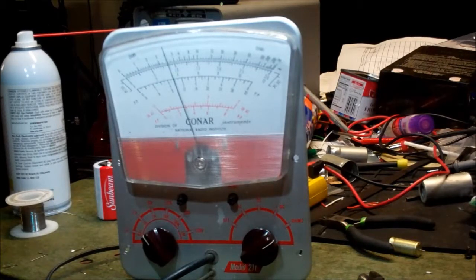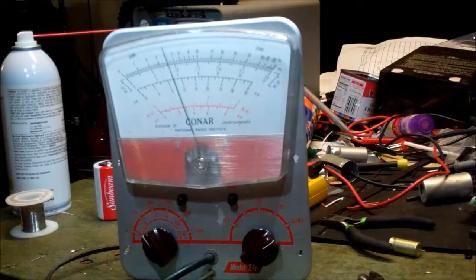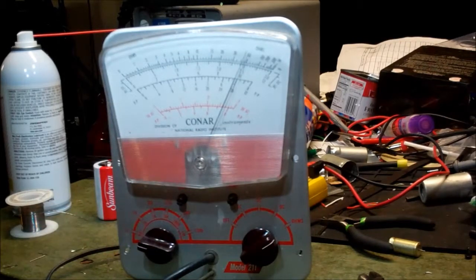Still not there. Well, this is no correction. We are there. Not quite, but we're around there, because on the ohm scale it'd be multiplied by 10, and it's showing like 42, 43 ohms, and we should see 47, which would be more properly read over here. That looks kind of like 47, so I think this thing probably just needs to be calibrated as opposed to having to be severely repaired.